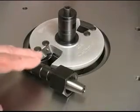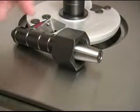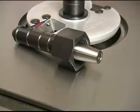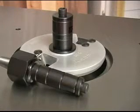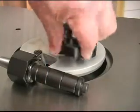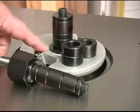Jet includes both half-inch and three-quarter-inch diameter spindles. The spindles have this tapered shank that are pulled into a seat using a drawbar from below. This large nut ensures that the spindle is fully restrained. Each of the spindles comes equipped with a full set of spacers on its shaft, provided in several thicknesses so virtually any thickness cutter can be installed on the machine securely.